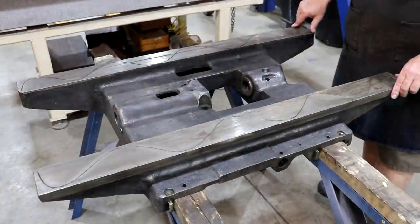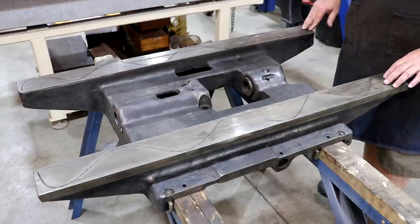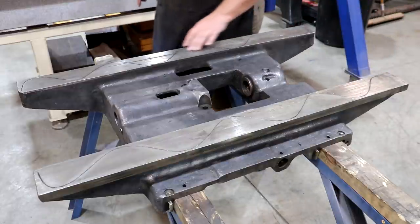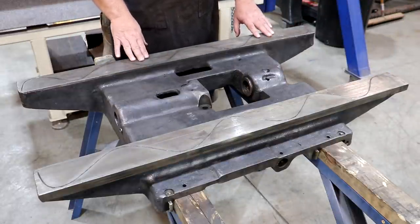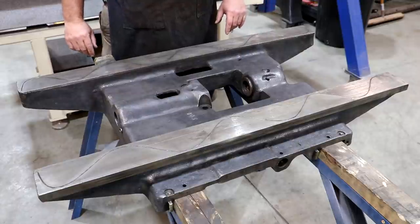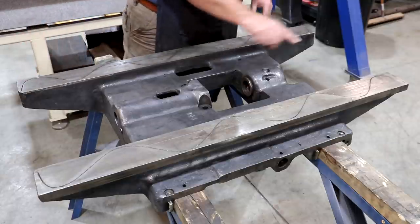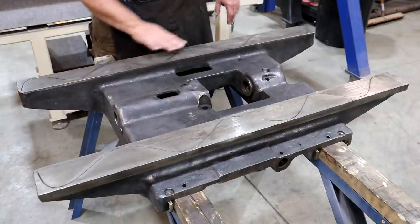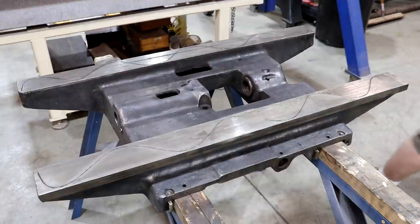Let me take a look at it before we start. This is the original surfaces and they appeared to be in pretty good shape. There is a little scoring in a couple places where some grit or something got up underneath those tables — that will be below the surface and I'm not trying to get those out. They'll basically become oil retention grooves. You'll also notice the little squiggly line through here on both sides — that is an oil groove that was ground below the surface, and that's the place where oil can travel around.